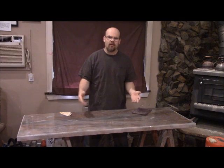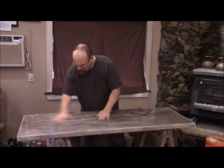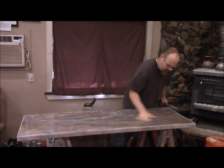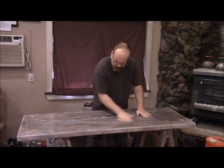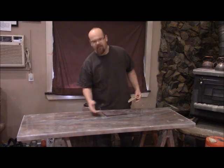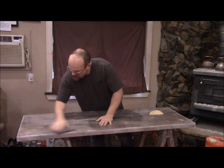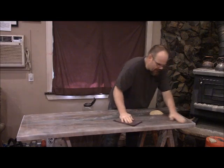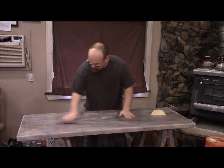I don't worry about dimples too much because I know I'm doing a second coat. On your first coat, because you're mixing all kinds of different stuff with the stone coat, sometimes you'll get craters. But the second flood coat is definitely a step up — it makes it look really professional. Down the road, if you ever want to refinish the tops, you can easily polish and sand them knowing you'll never touch the color. The flood coat will hide all of the sanding marks, so don't worry about them.